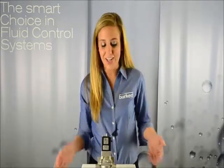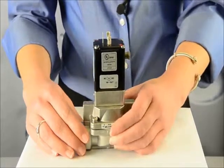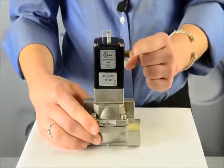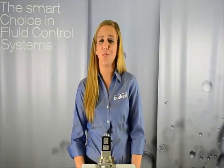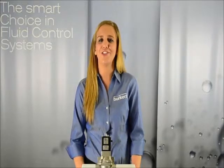I'd like to show you some of the advantages of this valve. The opening and closing response times are adjustable to your preference by simply adjusting these response time screws. The 5282 also comes with a standard manual override. It is available in UL and explosion proof and has various other approvals. Another interesting fact is that both normally closed and normally open functions are possible by simply turning the pilot 180 degrees.